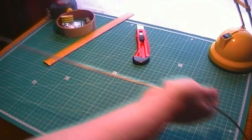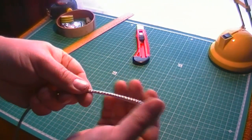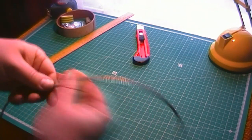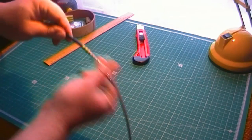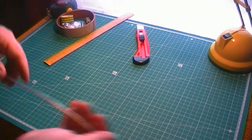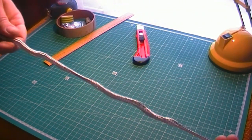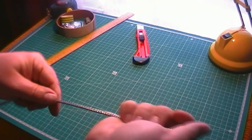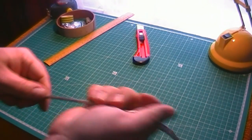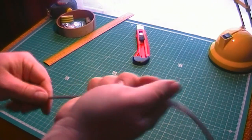Now this is where again you could go with a bazooka type antenna. You could do that lark where you balloon out the braid, relax the braid, and then fold it over and make a bazooka like in one of my other videos, but we're not making one of them today. So all I'm going to do is relax the braid from the dielectric. Might want to have a practice trying to get it to fold over, but you don't need it for the T2LT. Some people think it's a braid fold over antenna. It's not. That's that bazooka thing we did. Perhaps they call it a sleeve dipole.